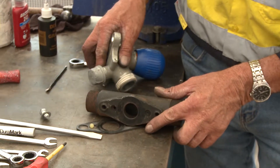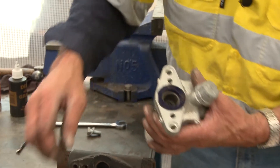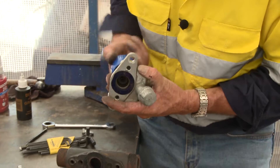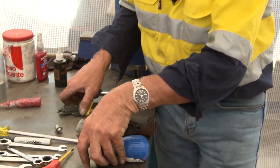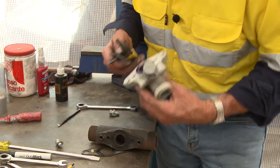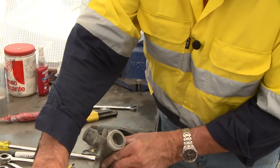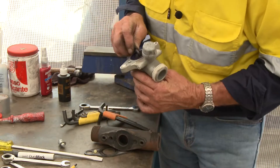So you've got a gasket, a body, and a piston. Can you take the piston out to inspect it? Absolutely. What you'll need is an Allen key that fits that particular Allen cap - you can see the Allen cap turning when you move it back and forth. What you'd be looking for after removing the Allen cap is the cylinder wall of the piston to ensure it's not compromised, scoured, or damaged. Note there are two types of Allen keys - metric and imperial - so make sure you select the correct one.